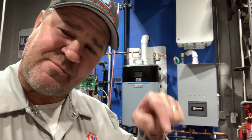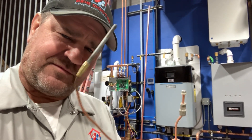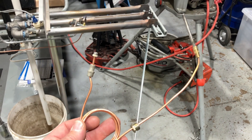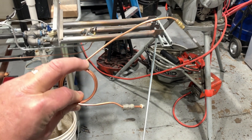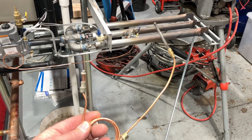When you're holding down the plunger on the standing pilot gas valve — on the water heater, when you let it go — as long as there's enough current in the thermocouple, it'll keep the gas valve open and give you heat or hot water. So now let's talk about how to measure this and test it. I always say: if you ain't testing, you're guessing. The next time you're at a no-heat or no-hot-water service call and you come across a thermocouple, you're going to know how to test it.